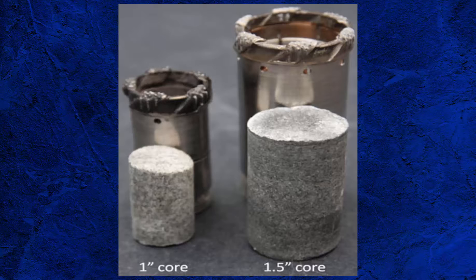However, there are a few systems on the market such as the Halliburton Examiner, Baker-Hughes MaxCore and Schlumberger's XLROCK system that will take sidewall cores of up to 2½ inches by 1½ inches. Analysis that can be carried out on sidewall cores is more limited than on full bore cores and is also affected by larger degrees of uncertainty.